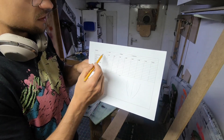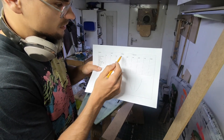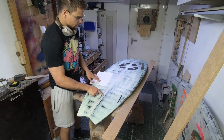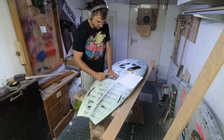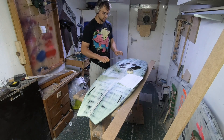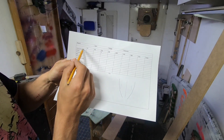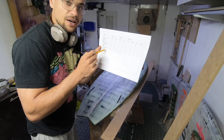I have this table and I marked on the board — everything is in centimeters — 0, 30, 60, 90, and so on. Zero is right here, not at the very tip, because the board ends there. I then transfer the measurements from the middle to the rail, because some measurements have to be taken at the rail, and I want to be really precise, so I'll use this right angle.